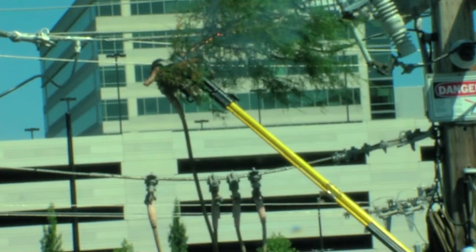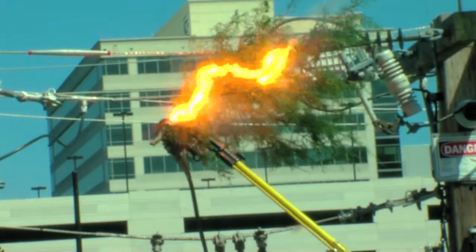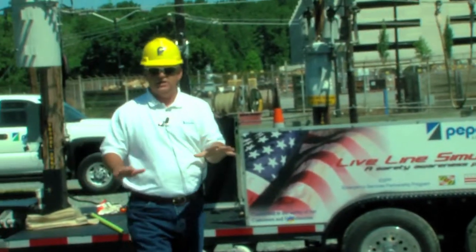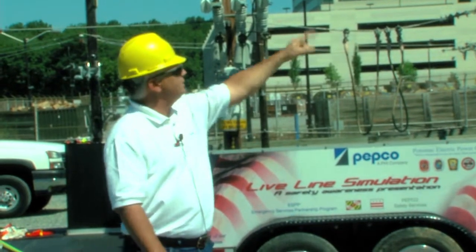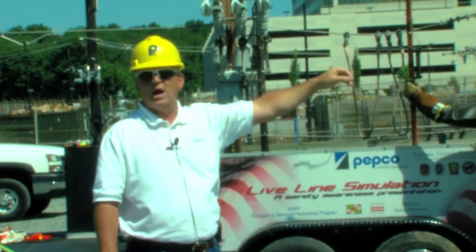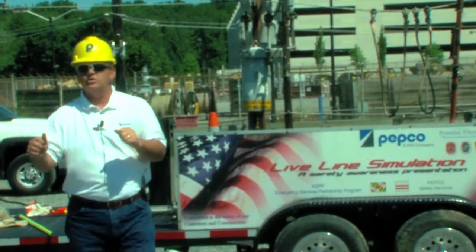It's never a wire that we feel comfortable telling someone, sure, it's probably communication, go ahead, because we don't know, and here's why. That wire comes down, and it's on the ground. It doesn't do anything, it's not moving. And it's a cable wire. What you can't see is two spans up, there's an energized electrical wire down on that communication wire, and it's energizing it. So there's really never a safe scenario where you can come and touch a wire.